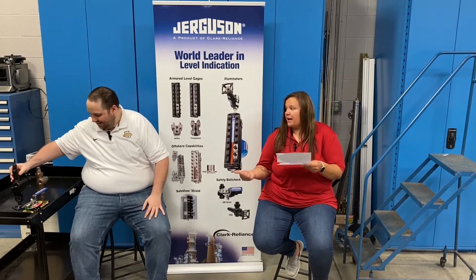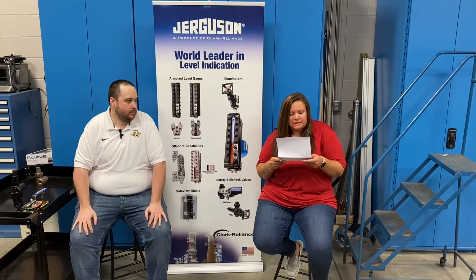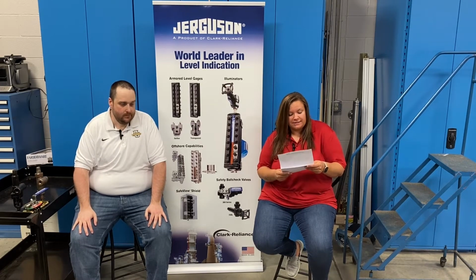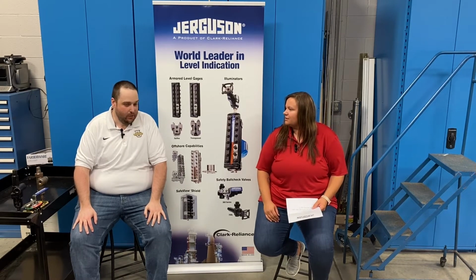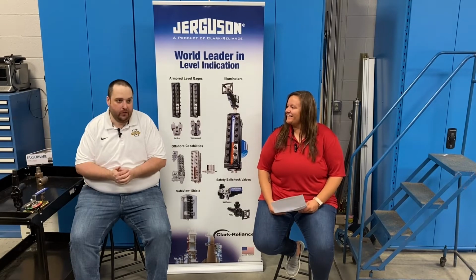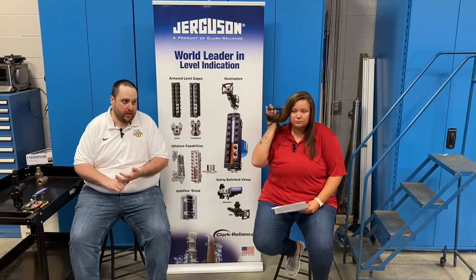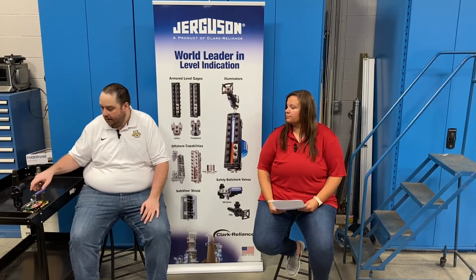Well, speaking of packing, just piggybacking off that, a couple of people actually have asked this. Can you use any packing options for low emissions valves? No, you cannot. We have all of the Jerguson valves that have low emissions. They all have graphoil packing. It's very common packing in the industry. It has a wide use of applications, pressures and temperatures and stuff like that.